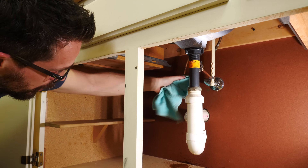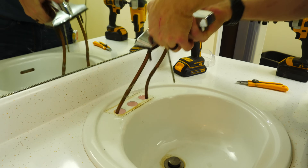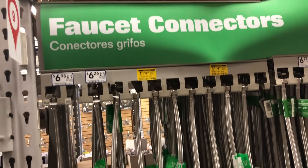When you actually go to replace the faucet, make sure to turn off the water at the supply lines underneath the sink. If you don't have shutoff valves there, you're going to need to shut off the water to the entire house before unscrewing those. Once the water's cut off, you need to unscrew the supply lines going up to the old faucet. Some older faucets will have the supply lines built into them, and if that's the case, you'll need to replace those with some new braided hose. You'll probably want to put a bucket underneath all of this before you start detaching any of the hoses because there will be some water that'll drain out.